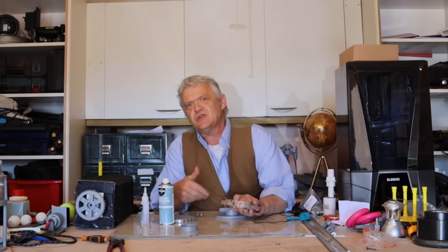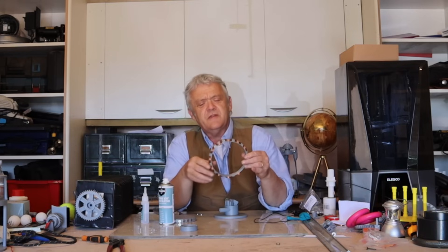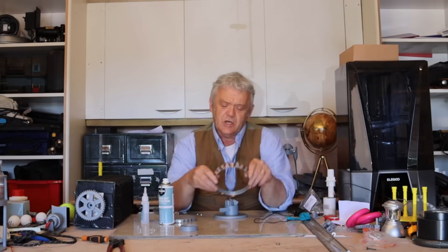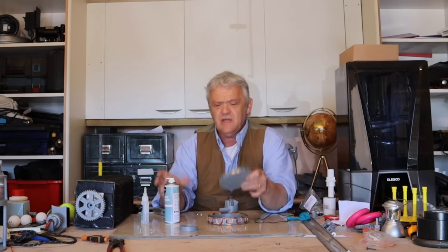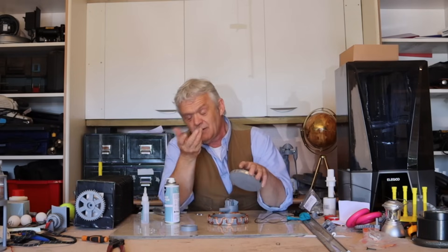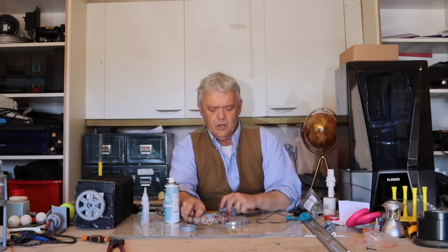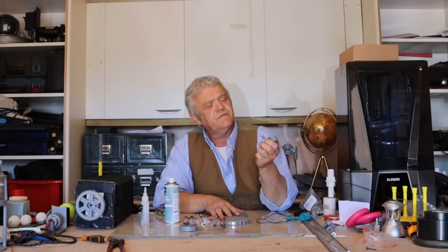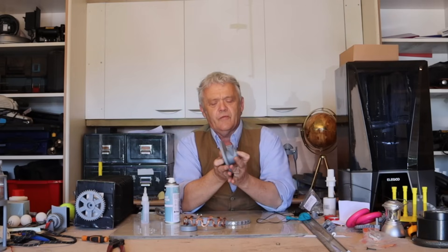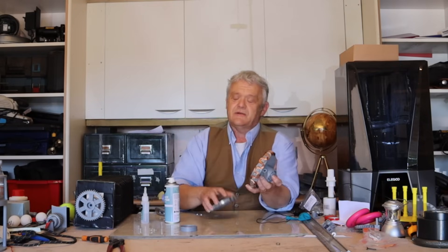I make a lot of these all the same way, so if you've been looking at previous videos you'll know about this. This is a serpentine coil — I've included the former in the file which is on Thingiverse — and I've wrapped 250 turns of 0.2mm copper wire onto that inner serpent. I've also made a disc that fits in there with 24 neodymium magnets, 1cm by 2mm, and they fit in that disc. That slots in there and can rotate, and when it rotates it's a generator. So we're going to put that onto our vane motor using a connection disc — we glue that on there and then put that onto there and that makes a generator out of the vane motor.